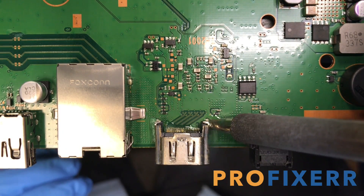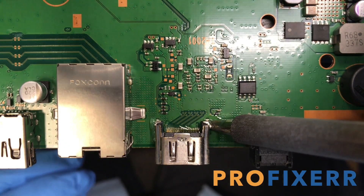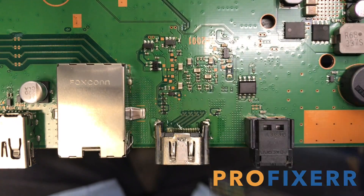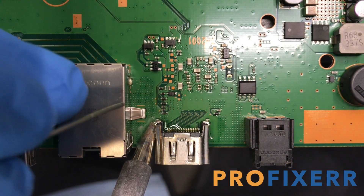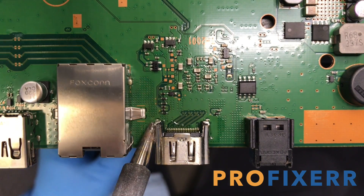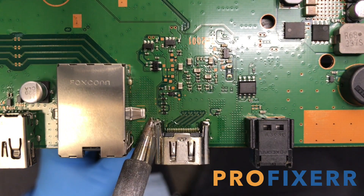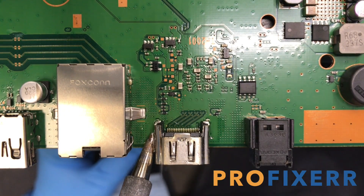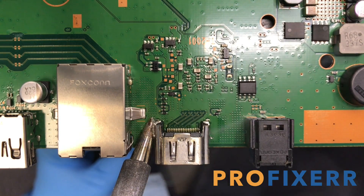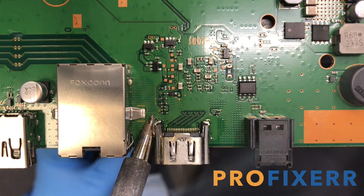The port does not cost a lot. It's not too labor-intensive. It is moderately skilled, but it's pretty easy to do. In this particular part, the iron that I'm using is actually a Hakko FX888. I just have it set to 750 degrees, with a regular chisel tip on there — it's like two and a half millimeters wide. It's a large tip, definitely a lot bigger than the pins, but it's going to help us a lot with heat transfer.